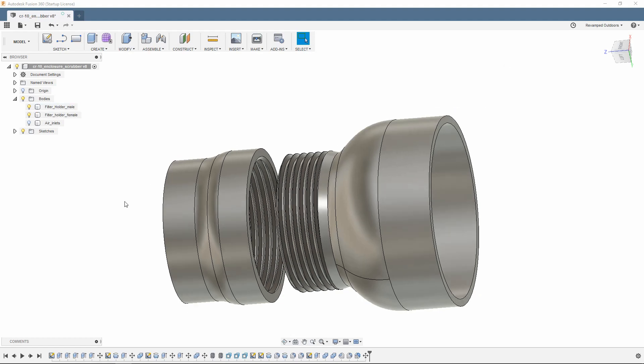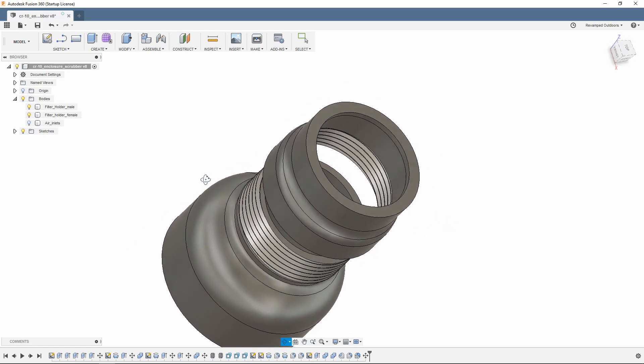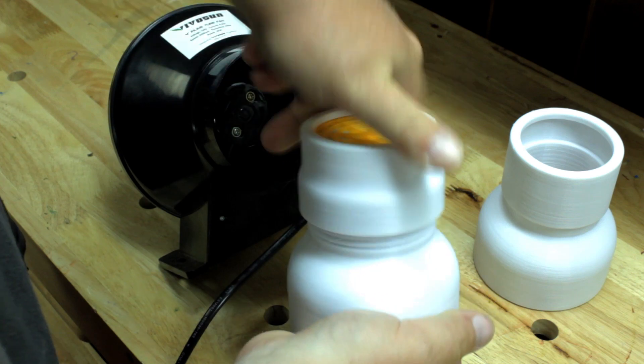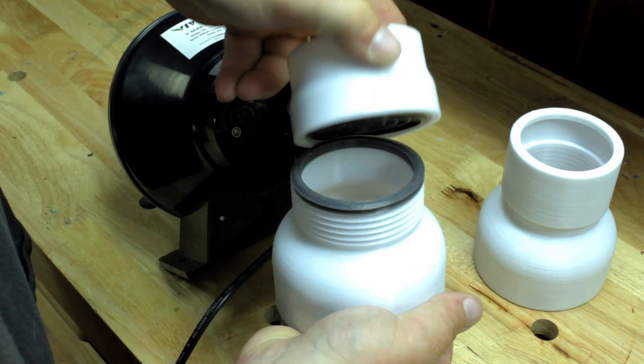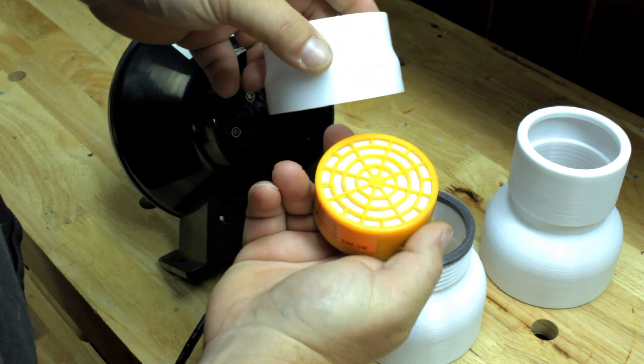They're used for small vapors — anything that gets atomized. You want to have a respirator on so you're not breathing in spray painting and stuff like that. These cartridges are activated carbon, about 72 millimeters diameter. So I hopped into Fusion 360 and mocked up a reducer. It goes from the inline blower fan, reduces down to about three inches, using some vinyl vent tubing. In that reduction I have a screw-on that fits this filter — it screws onto the reduction and then goes to the tube. The air flows across the activated carbon, cycling from the top of the enclosure back down in. It seems to work.